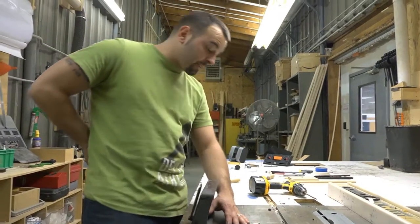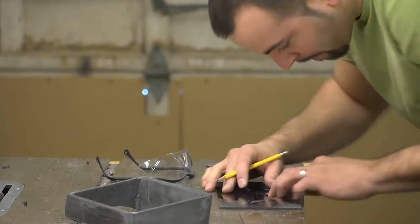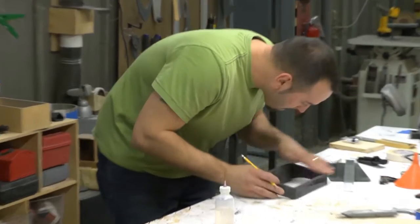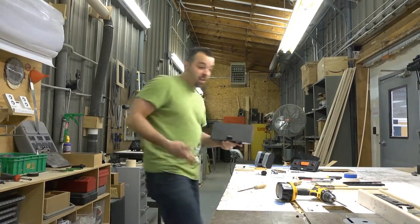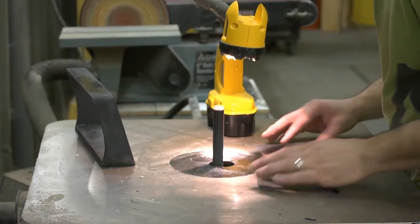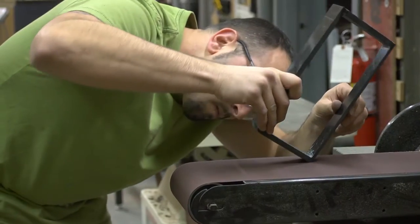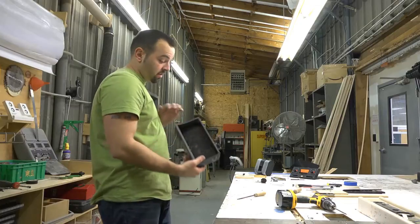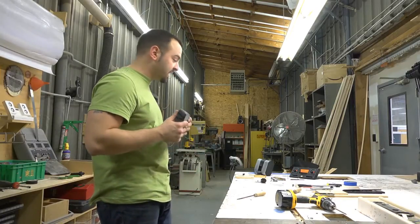When we do prototypes back here, we generally do them sonically correct first, and then we deal with what it looks like and try to polish it up. To make the box right, you're actually gaining a lot sonically that you cannot get with electronics. Some easy things to do acoustically is have nice curved edges, no sharp edges. The inside of the box, you want it to be braced, which right now this one's not, but before I get done with it, it'll be braced up so it's really stiff.